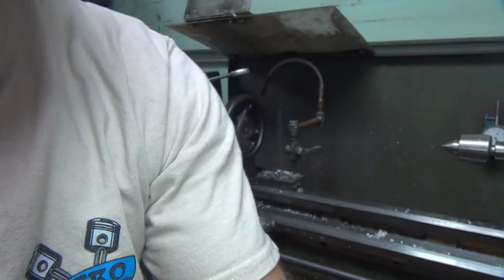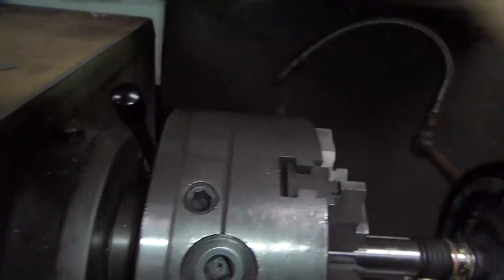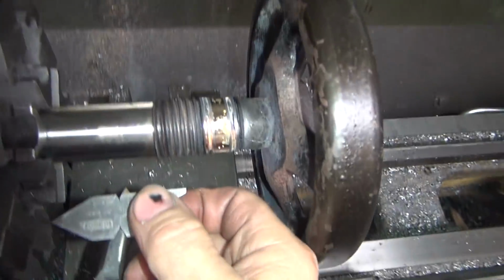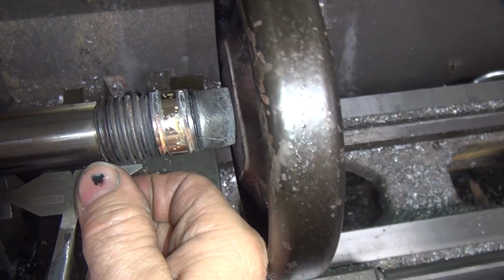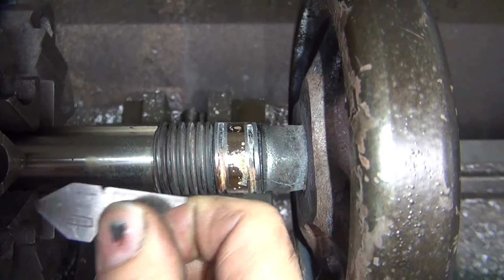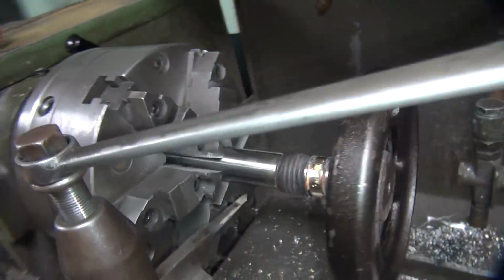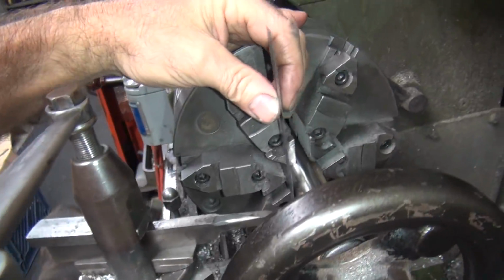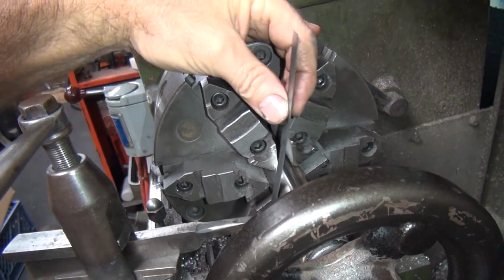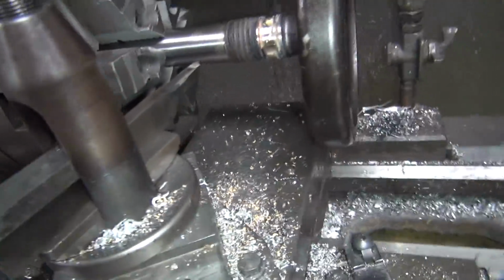This tripod ain't going to help us at all in doing this job. An overhead shot like this to see what's really going on. And I got to use my other hand. Okay, so this here goes on here like this. You make sure your bit is straight, parallel to your part, and you know that's in there straight. I did my tangent line over here on my bit, so it's going straight up and down, not angled like that or like that. So that means the cutter height's at the right spot.